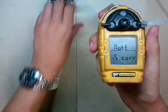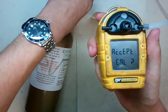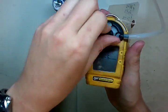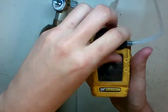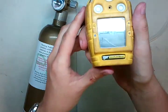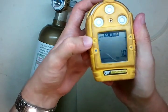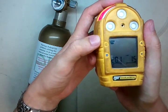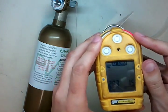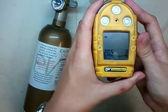So now we're going to turn this gas off. We're going to accept the calibration — that calibration is great for us. Take our cal cup off. Cal adjusted. Now it's going to go through the alarms — we don't care, so exit out of that. Now it's an alarm bug, so it's upset with us. Press the button and it'll be quiet.